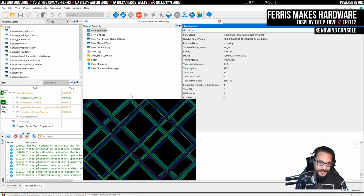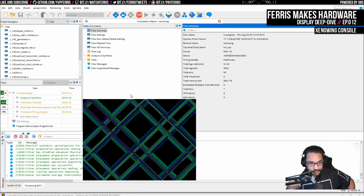Because that 16 by 16 fits in a register. And it might be that we end up doing SIMD as well, where we can specify groups of registers to be a vector. And again, we might be limited on that in terms of bandwidth through the actual register file itself, but maybe we can have additional register files for vectors. I don't really know how it's going to look yet, but thinking about some kind of integer SIMD for the CPU is basically my point. That will help feed that pipe.